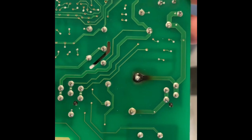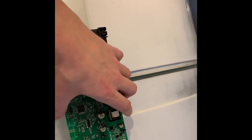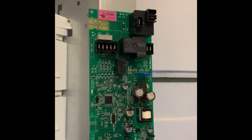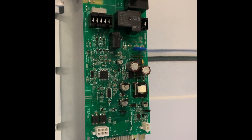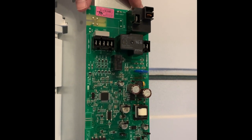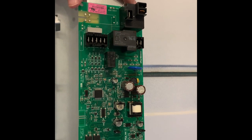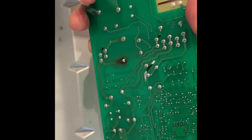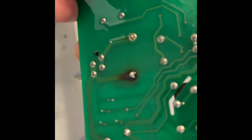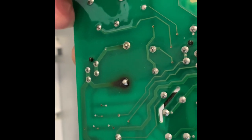Lo and behold, you can see pretty clearly where we have a problem — there's a burnt section. Now full disclosure, I have taken this dryer apart before to verify that this is where the failure occurred, which is what a lot of YouTube videos will show. They will go on to say order this whole control board for two, three, four hundred dollars, whatever it's going to cost you, and then just reverse these steps with the new board. I wasn't very impressed with the price of these boards up here in Canada — they want something like four hundred dollars and they're back ordered. This is a relay where you can see smoke and some sort of overheating has occurred, with black markings. I tried to resolder it but that didn't fix anything, which was not really surprising.